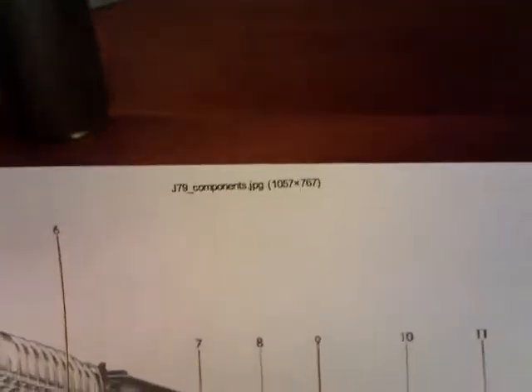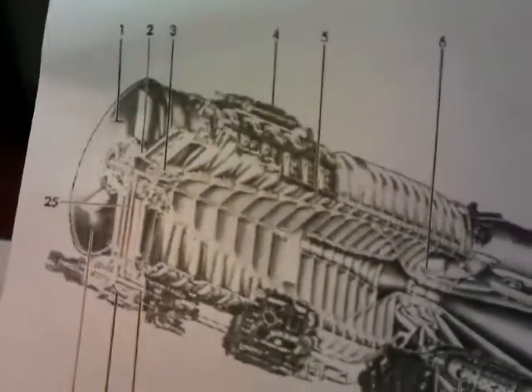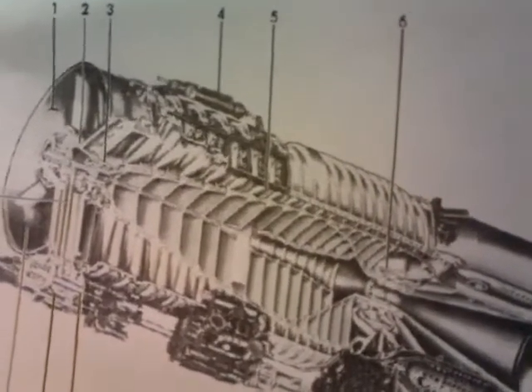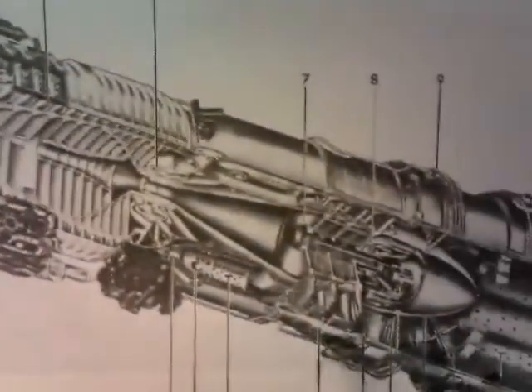What I'm going to do is focus on the J79 jet, from the 50s, with the stainless steel. I'm going to make the front compression section — there are 17 fans in the original one, I'm going to be using 7 fans in mine, so not exactly the same, but this is what I'm basing it on.